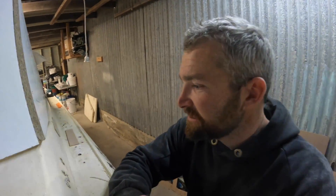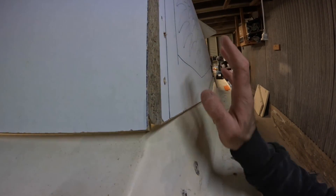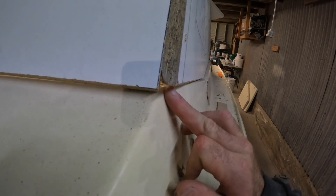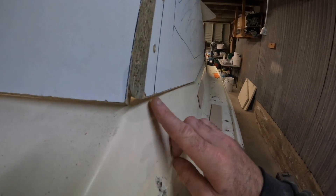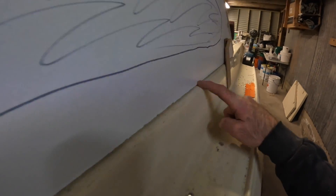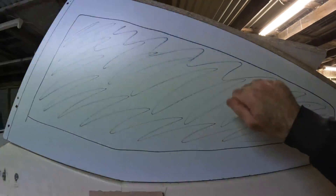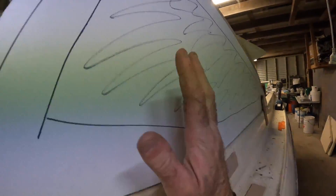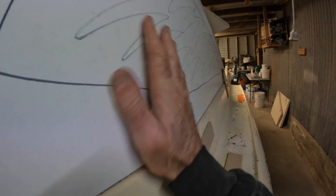The actual curve of the boat here is a tricky one. Rather than make the wave breaker mould suit the side of the hull, I've brought the edge of the wave breaker right out to the very edge lip where I want to start my wave breaker glass section. When this is just a sheet of glass — not on the solid melamine — if it's not too many layers to start with, it's actually going to be pliable. So I'm going to be able to bend it and tack it exactly where I want it along here and give it a little bit of shape, then glass it for a nice smooth look up the side.